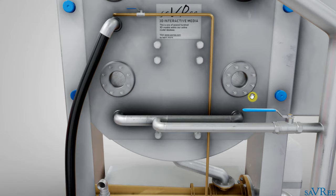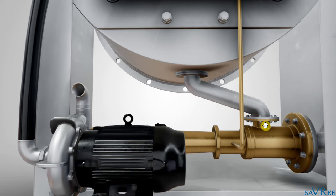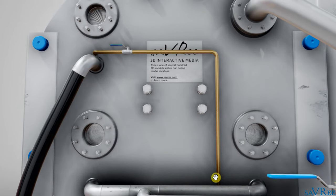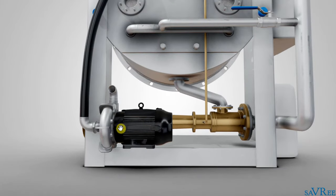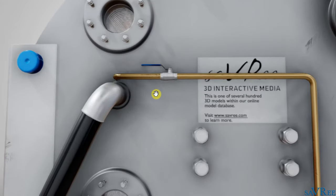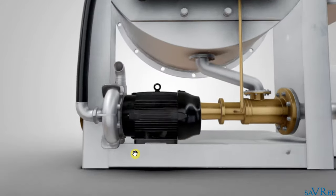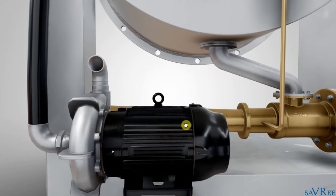Let's go through the rest of the components. The ejector is drawing out of the base of the shell, and there's a small pipe connected to the ejector that's going to allow us to maintain a vacuum within the shell. We've got the fresh water pump — a small centrifugal pump — and we're gonna use that to draw fresh water out of the generator, down into the centre eye of the pump, and discharge it through this pipe to a storage tank.